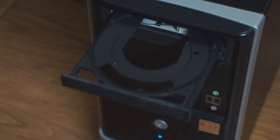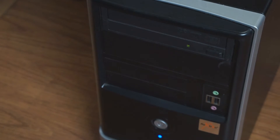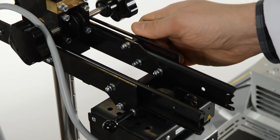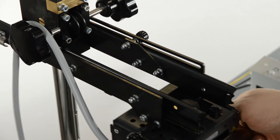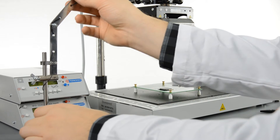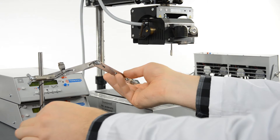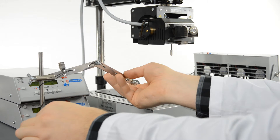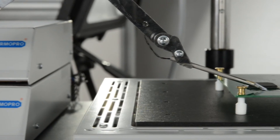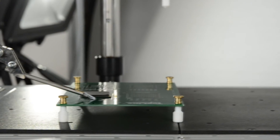Set up the ThermoProCenter software on your computer in accordance with the software manual and computer specification. Adjust the vertical position screw on the top heater holder and its horizontal slide fixing nuts to a force convenient for you. Lay the control sensor on the working zone of the PCB-supporting control sensor tripod arm by hand, with reasonable care to prevent sensor damage. Correct positioning of the control sensor is a critical feature of the process — please read the information about it in the manuals and other documents available on your CD.